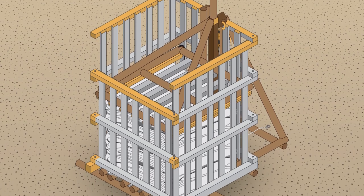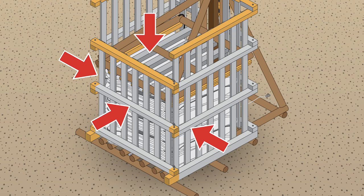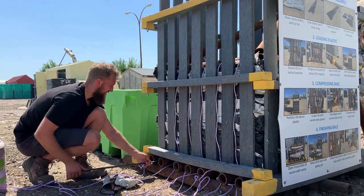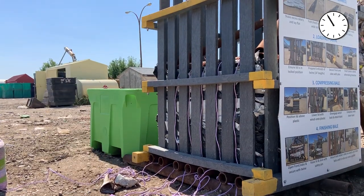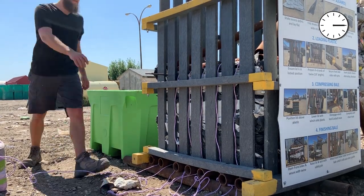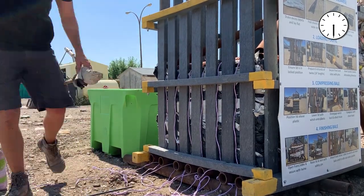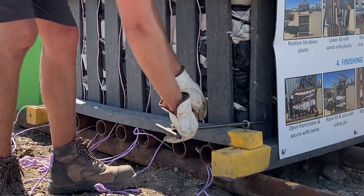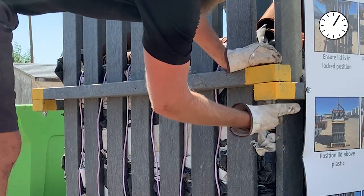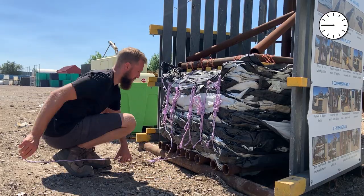When your compressed plastic is at the desired height, the next step is to secure it as a bale while it's under compression. Keep the lid down on the plastic with the front and sides of the compactor closed. Use the metal threading rod provided to thread six strands of baling twine under and over the plastic bale, being sure to thread the twine inside the frame of the compactor. Then, using the threading rod for leverage, remove the three gate lock pins beginning with the bottom pin. Open the front door and fan out the two sides to remove side pressure, then firmly tie off the six strands of twine to secure the bale.